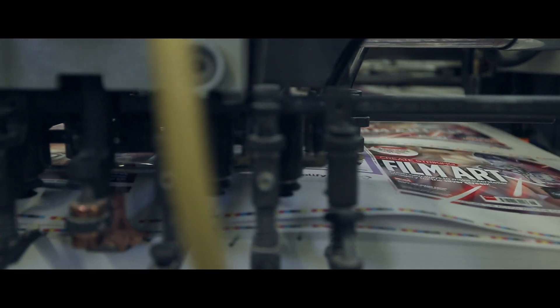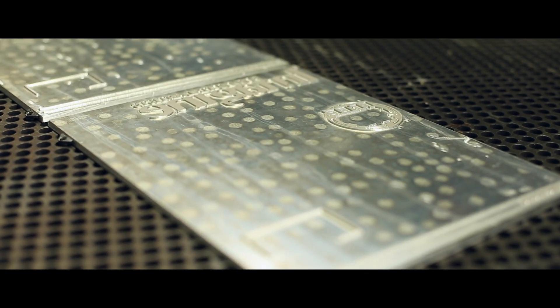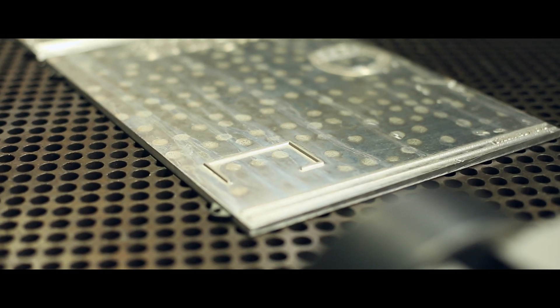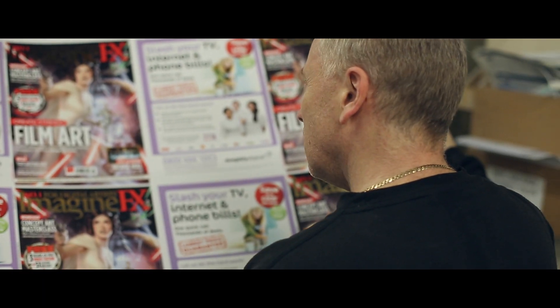When we look at the job going through the machine, we can see the foil ribbons working through — you can see them moving. What they actually do is run through between the dies and the make ready. And as they get to the dies in position, there is a stamp, a pressure that comes down, that stamps the foil onto the sheet to give it the impression that we want.